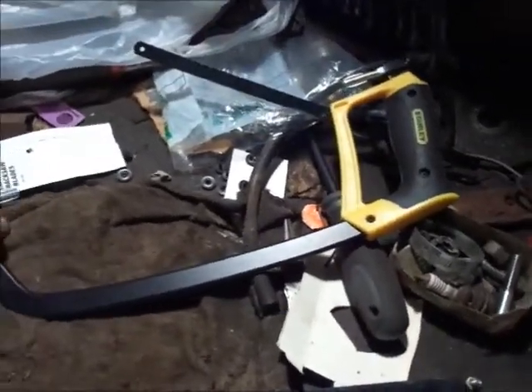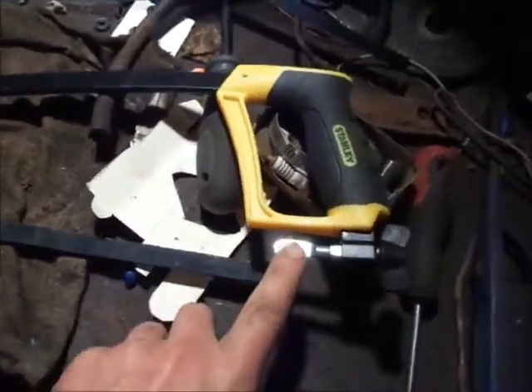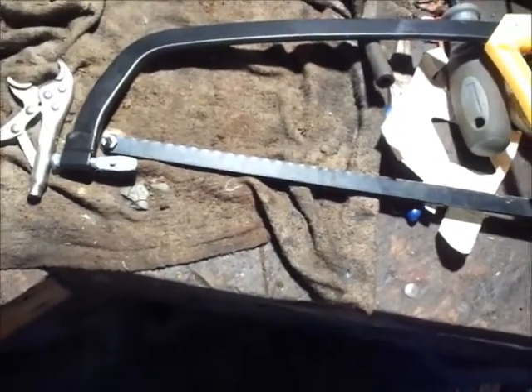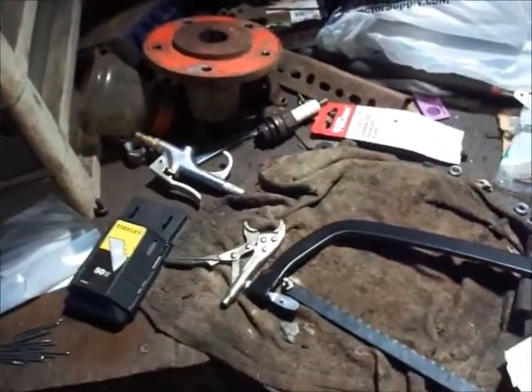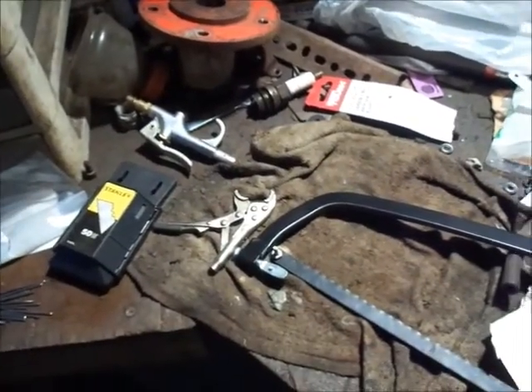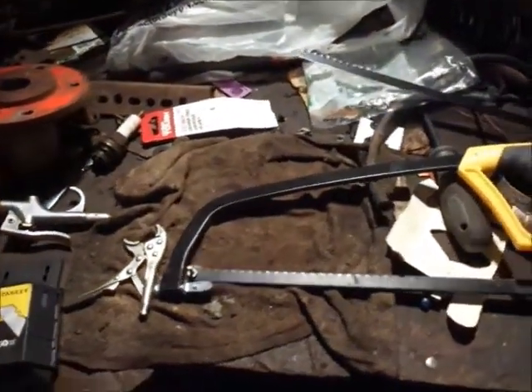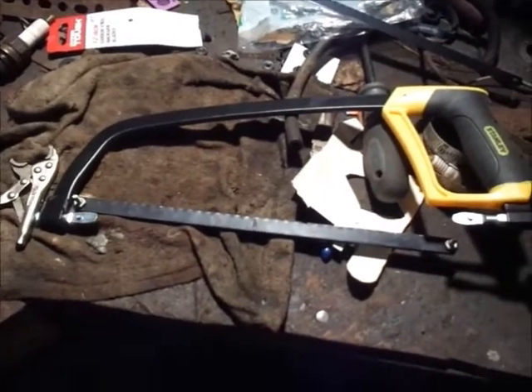What I'm going to do is where these nubs are, I'm going to have to drill down through them and make holes for the bolts to go through, then bolt all the hacksaw blades to this side. We should then be able to hook that up in a vise, take the hacksaw, cut a new keyway, and drill a new set screw hole. I have a whole stack of hubs I can do this to.